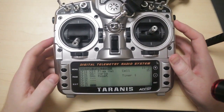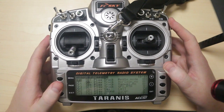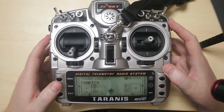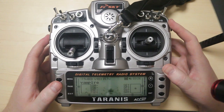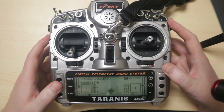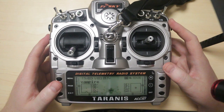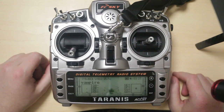That's about it in terms of setting up telemetry. I think those three are the most important ones, but definitely the voltage meter is the most important — you really want to have that in place to protect your airframe and your batteries. You're going to get a much longer life out of your batteries if you use it. If you have any questions feel free to let me know, I hope this has helped, and if you have other questions I can make more videos. Thanks.